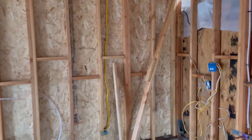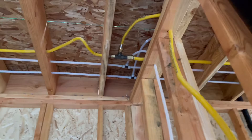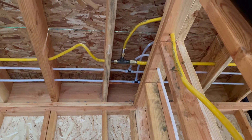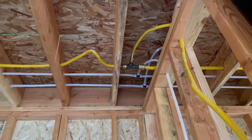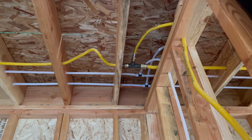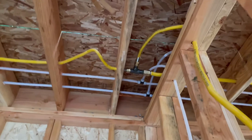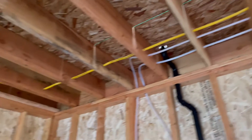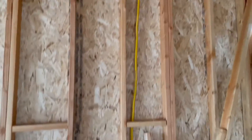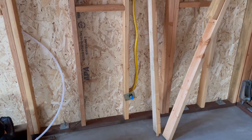Moving over towards the kitchen — there's the three-quarter-inch transition down to a half-inch tee. We reduced from three-quarter to half-inch where we came out for the washer/dryer connection right here, and we come straight across and down here for the range.